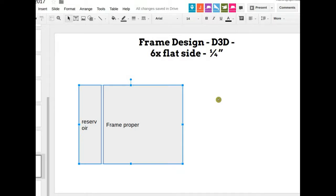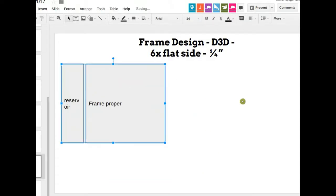And the other thing being, if you're bending, you need a metal brake. Otherwise, it's a pretty tough job. So we're saying, okay, no metal brake, no metal press. We're just going to say we have a welder and a CNC torch table. And that's how we do the frame. So what do you do? So if you're going to do a frame integrated tank, that's how the pieces would look.